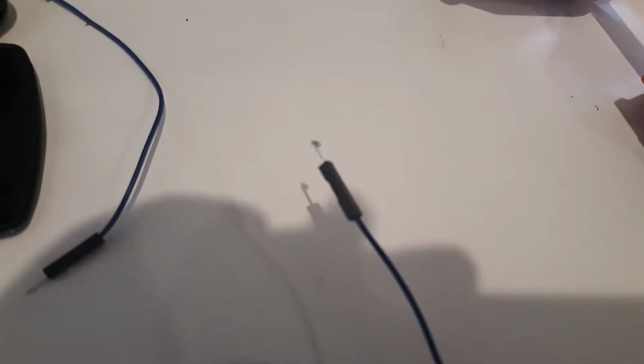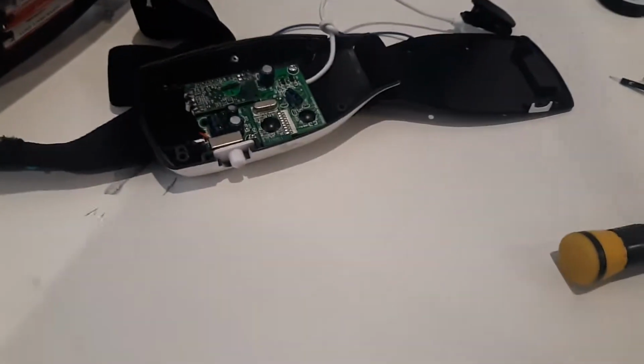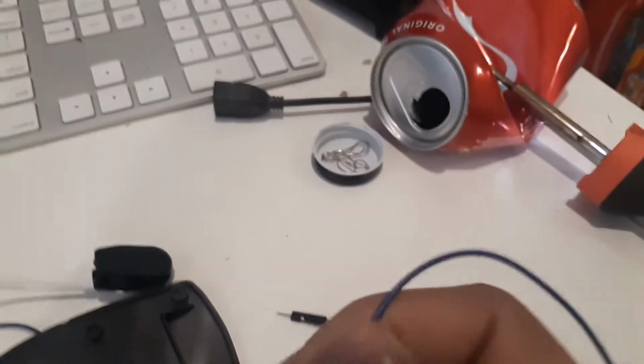All right. So I have put a bit of solder onto the end of this wire here, and I did that twice over so that I have a double-headed pin, and I'm going to just solder that onto the 4th pin here as a transmit, and then I'm going to solder this one into the ground, and then I will have 2 wires coming out. Those 2 male pin wires are going to connect to these little female pins. So one second here. Right, that little pin goes inside of a female pin.